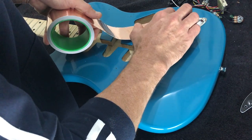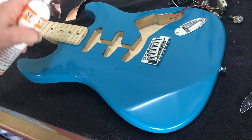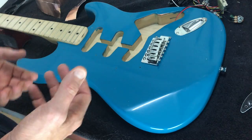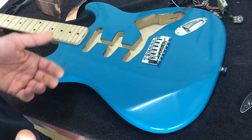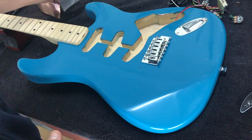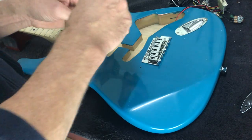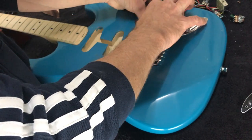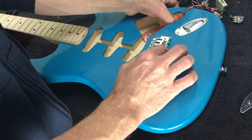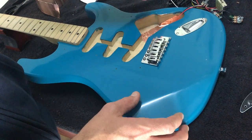The first thing I'd do is cut approximate lengths of tape — make sure you have good sharp scissors. I'd also clean out the cavity first. I'm using some compressed air for that. Another trick is to use masking tape applied directly to the bottom of the cavity, then lift it up — that should remove any dust or residue. All we're trying to do is create a clean surface so our tape adheres nicely to the wood. From there, just start lining the cavity itself. A couple of things to keep in mind: it's really important that you don't leave any bare spots. Every piece of tape you put in needs to overlap with the next. You can test this using a multimeter — just test two separate points and make sure you've got connectivity.